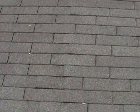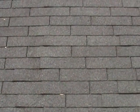When they shingled this house, I would have probably had this area done in roll roofing and run it up probably a couple feet on each side. But what they did, they ran three-tab shingles and overlapped them further to compensate, hoping it would shed water better. But that actually makes things worse because they never get a chance to glue down good and water can blow underneath them.